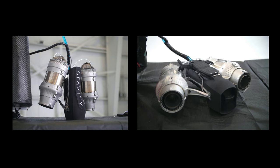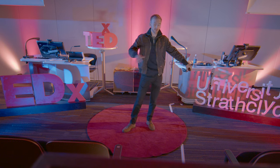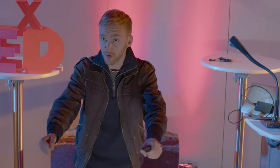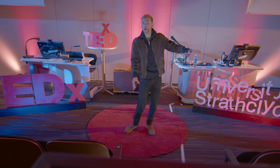Then I moved on to the arm mount design. You can see in the centre a nylon arm tube — because that can be lightweight and it's not under a lot of heat load. The turbine housing around the sides is 3D printed aluminium. This is possibly the most minimalist design of arm mount we've actually created. To explain how the jetsuit works: you've got two arm mounts and one backpack, all three providing one of three tripod legs of thrust. Put both arms in front and you go backwards; put them both behind and you go forwards. That creates a very stable curtain of thrust that keeps you in the air and allows you to control yourself by moving your arms.